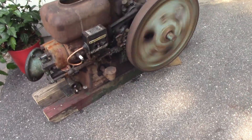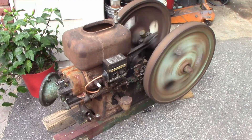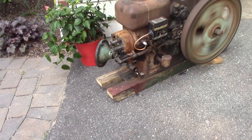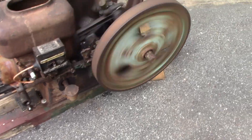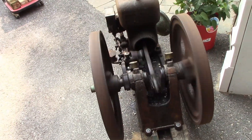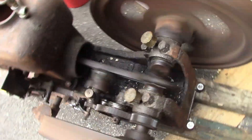That's as it should be folks - just one pull and it's off. If you've seen the last video you'll realize this thing sounds a hell of a lot more strong now. It's got a real crack out the exhaust like it should, instead of all the compression just leaking out the valves making more of a little poop sound. This is its new max speed - originally the max speed was more like this. I adjusted the governor a little bit so that it runs a little bit slower, and if I ever wanted to belt it up to something it'd definitely have enough speed.